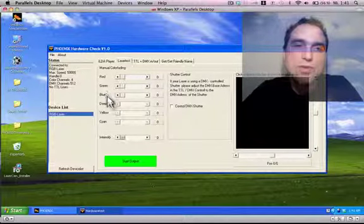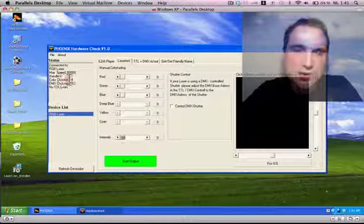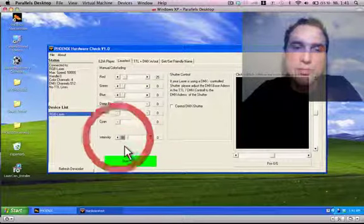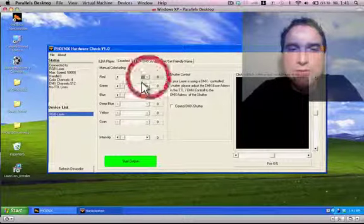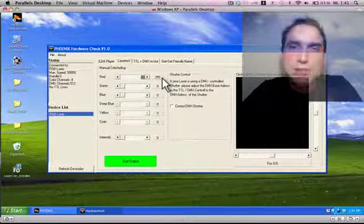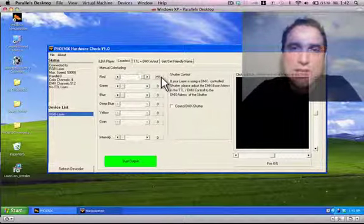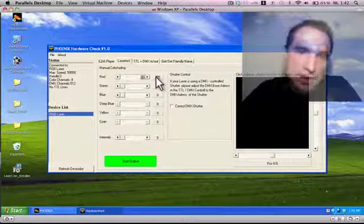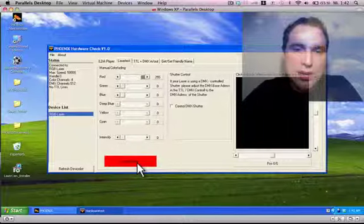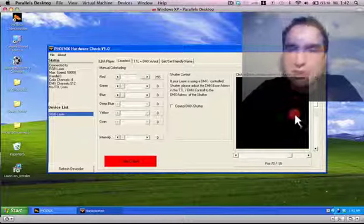You see here now red, green, blue, deep blue, yellow, cyan and intensity. Because your interface has only 4 colors, as you can see here, you get only the red, green, blue and intensity available. So if you push the red slider to 255, you get a 5-volt signal now directly on your module, and it's not blanked at all. So let's say you have a 500 milliwatt laser diode, then it must come out 500 milliwatt now, in this moment.